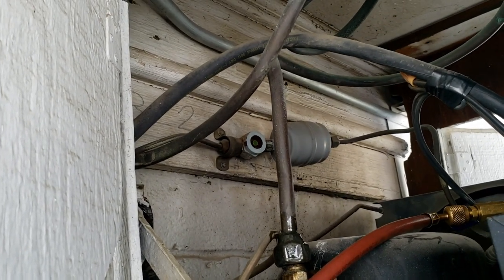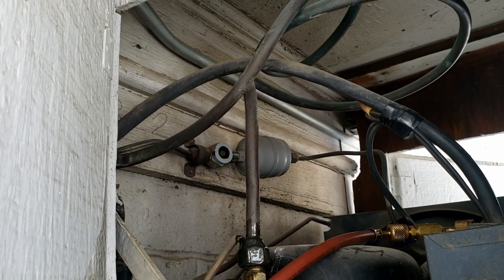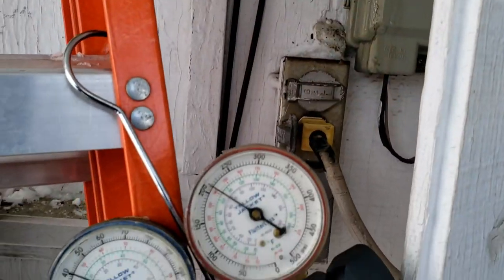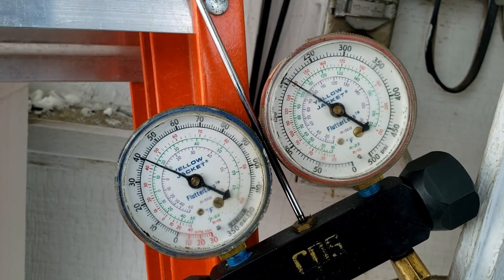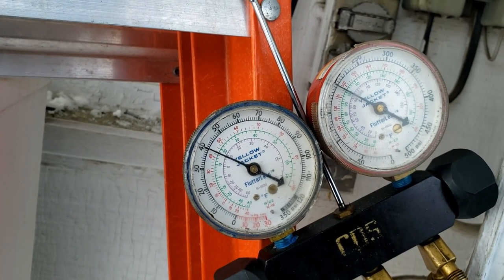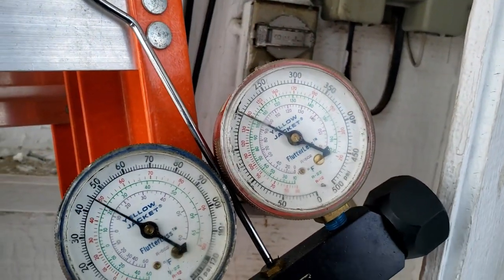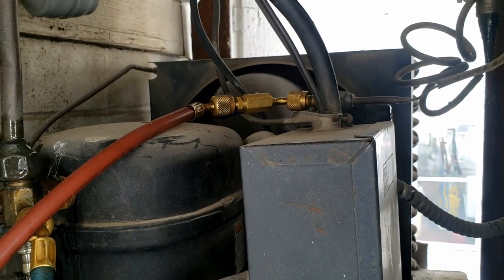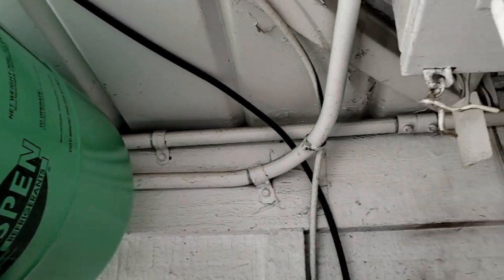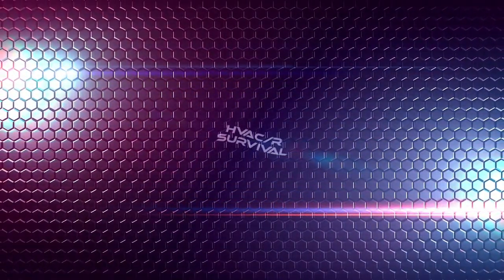I don't have a filter dryer in quarter inch so I'll change it later - the dot indicator on the sight glass is green so I'm not as worried about it. It never really went into a negative so I'm not as concerned. I'm slowly charging this thing back up with R22 - it's mineral oil so it's not as problematic as POE, but you still need to pull a good vacuum and all that. Pressures are pretty much where you'd expect them - cycling off right around the 100 degree mark and the evaporator is running right in there at about 15 to 18 degrees. Seems like it's tuned in pretty good. I'll re-weigh my bottle, note exactly how much I put in, and mark it on the unit so we know for later.